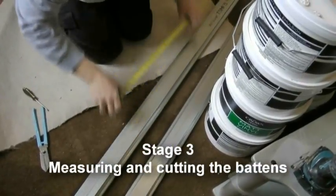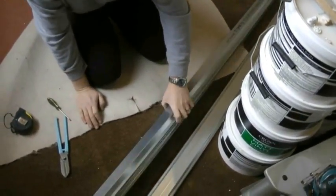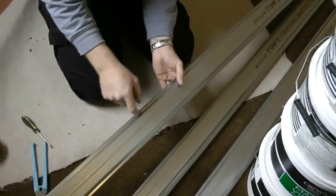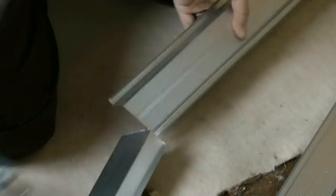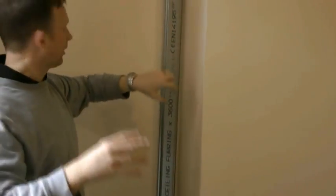I've measured up the wall to find out the height from floor to ceiling. Now I'm marking out the wall battens — these are the wall battens that go across. They've got an indent groove here which we'll put some pilot hole drills into, and then these will be drilled to the wall. We've just got a tin snipper, which is very sharp. As you can see, all tin snipped up — one of these will go external, giving us something to fasten the plasterboard and polystyrene to.